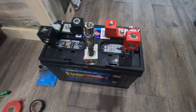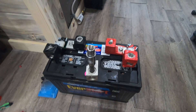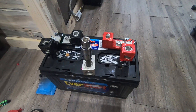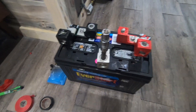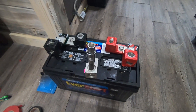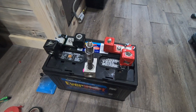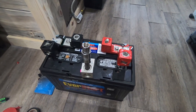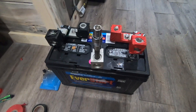I use a big fat welding cable — it's on there good, can't move it. Then I'll go on to the next battery. This makes changing out batteries pretty quick too, and I can still get to the water and check the level on them. I like color-coding the lugs — that cuts down on human error and trying to arc something out when you're in a hurry. That'll eliminate a lot of headache. I've got where the cable can go in, I cut the tape off — just one of the tricks I do.